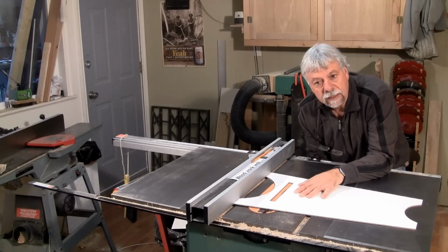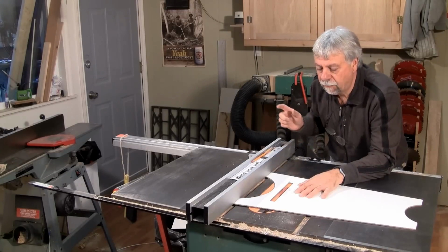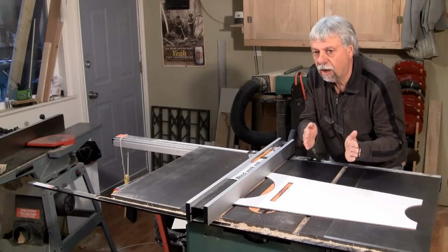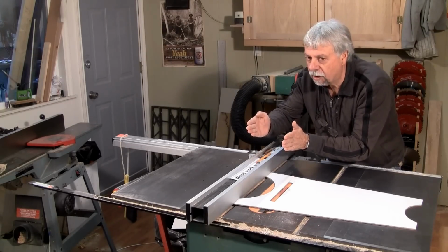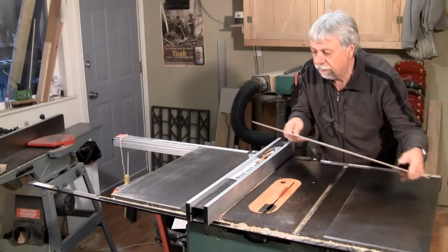And you'll have to be exactly 3/4 of an inch. And I actually made a few cuts because I wanted this absolutely perfect. So I moved the saw or the fence away, and it wasn't quite enough, so I moved it a little bit more. Still wasn't enough, just a little bit more, so that I could get that slot absolutely perfect.